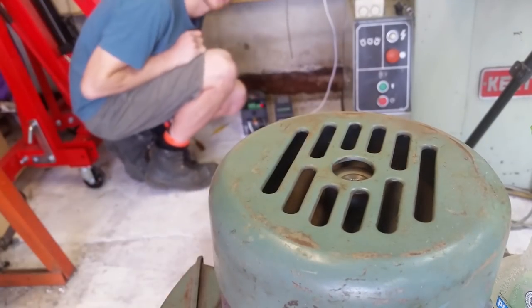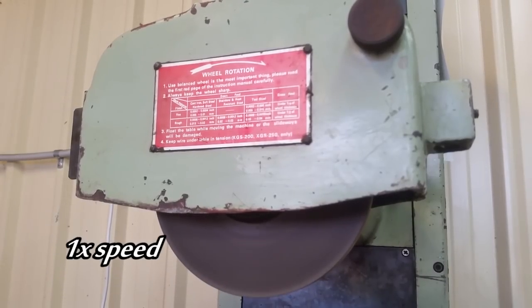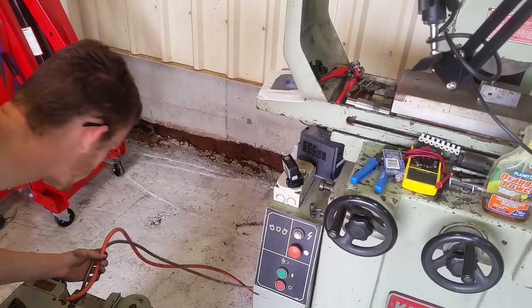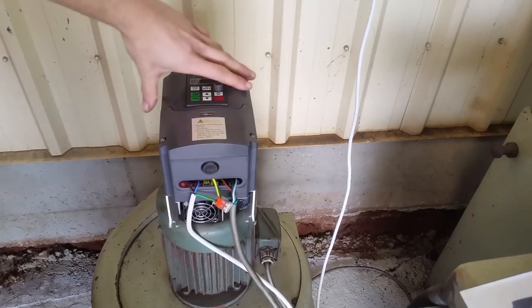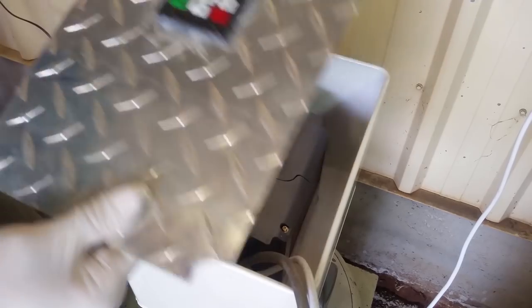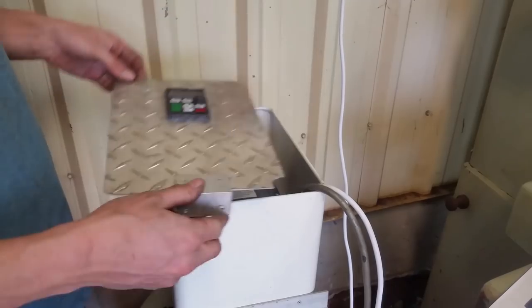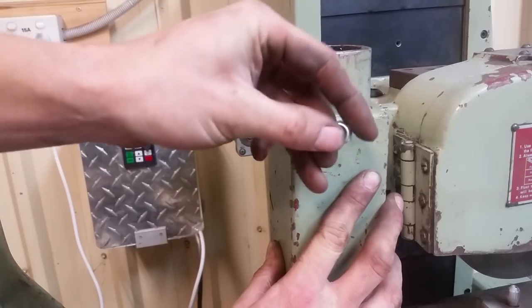Our dust extractor is spinning the right way — fantastic. Coolant spinning the right way — you could say I'm pumped. And there it is, set up. This guy has an IP rating of 20, so not ideal for a metal workshop. IP20 pretty much means you can't stick your fingers in — it's got zero dust protection, which isn't great around a surface grinder. I'm going to make an enclosure. So off to the side I made the panel and did a terrible job containing the silicone. On the backside I've just used hot glue, so I've got a double seal — the hot glue makes it a more rigid connection.